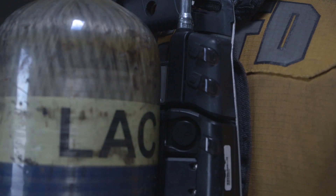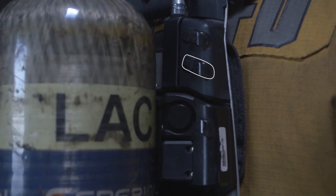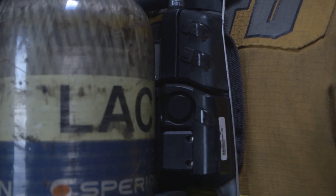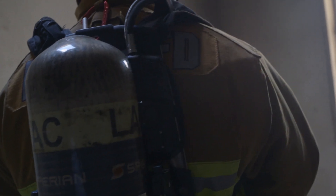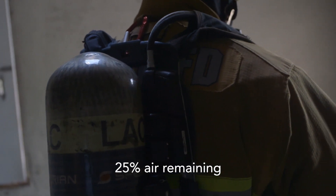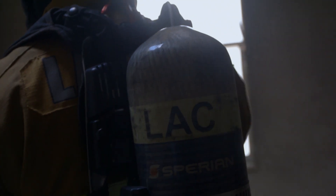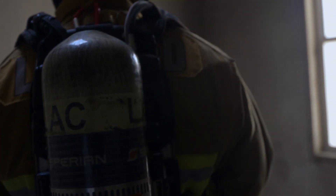Backpack warning lights: operational batteries will cause the amber lights on the backpack to flash every 10 seconds. Low batteries will cause the amber lights to flash every two seconds. A red light above the amber battery status will blink when the user's air status has reached a quarter of the supply left. In normal operation, alternating green LEDs blink every second on each side of the air cylinder. PASS activated: alternating green and red. PASS full alert: red LEDs blink every second.